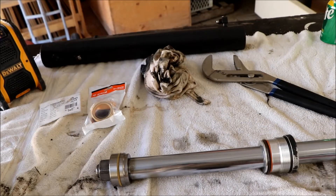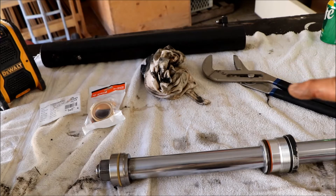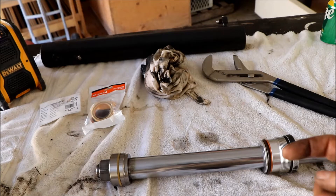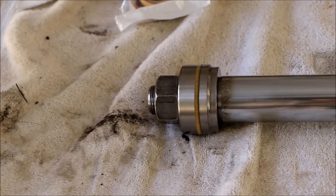We lost the footage for taking the cylinder apart but it's pretty easy. This part here screws into the cylinder end - using lefty-loosey righty-tighty you just take this off. This housing is aluminum so you have to be a bit careful. I purchased large channel locks and that seems to work fine - you can buy a special tool for it. Here we have the ram portion of the rod and this bolt has to come off. Looking at all the videos on YouTube it seems to be quite the task - people using four-foot breaker bars and all kinds of things.